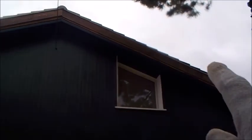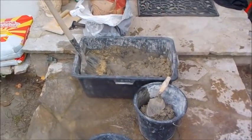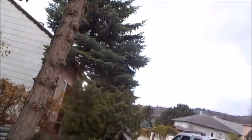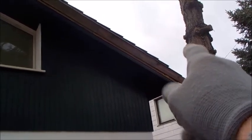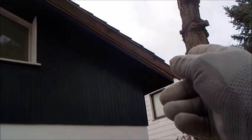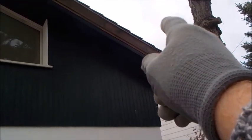I've got to do down there now. I've just mixed up a load of cement, and when I've done that, I can only do down 1, 2, 3. I can only start the third one up because I've left a tile off at the bottom, and when I lift those tiles up to put that last tile in, it will upset the cement work, so I'm starting 3 up.